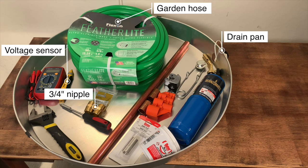The screwdriver is for the electrical connectors and the wrench is for tightening the nipples on top of the unit. Everything on the right is going to be used to connect the TPR — the temperature and pressure relief valve — to the new unit, and this is arguably the most complex part of the install. When connecting the cold water input or hot water output you can use flex connectors, which are cheap and easy. But the code in most municipalities requires a rigid connection to the TPR valve. My new Rheem Marathon is both taller and wider than my old unit, which is typical because newer units require more insulation.